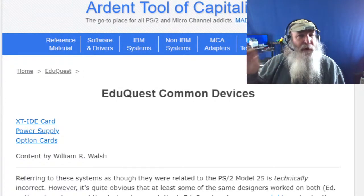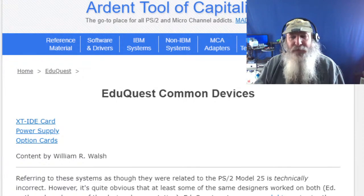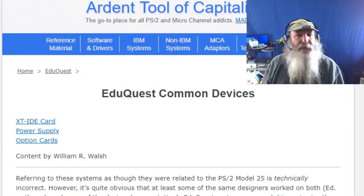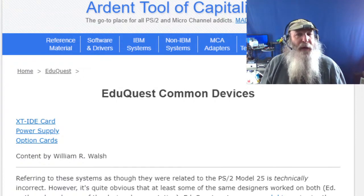I could almost go through and by memory relate what the FRU number is on those ASIC chips that are for VGA. But that's the only one that is branded purely as IBM, that you can see originated from IBM. And that silver cap chip is on other PS/2 planars, Micro Channel planars. But all the other VGA chips that IBM has on the planars otherwise have the Seiko Epson logo on those chips. So it's a really interesting thing.